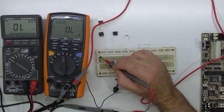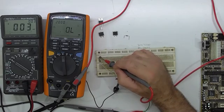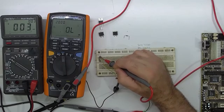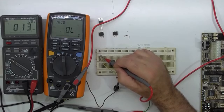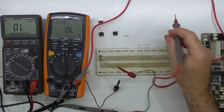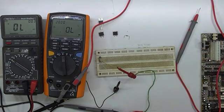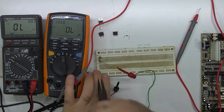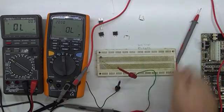Hit the gate and there we go — it drops to zero. We're getting very low on resistance. One of the advantages of MOSFET switching is that when they operate you're in the ohmic range typically, so they have a very low on-resistance and the voltage drop is proportional to the current flow. Just to prove the point about it staying on, I'll remove the 2.2 megohm resistor — and I've just touched the gate, and it should stay on.